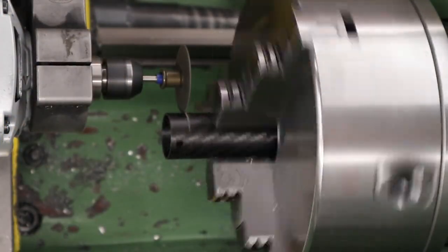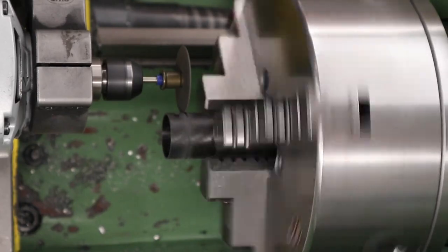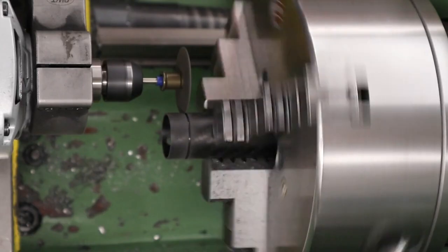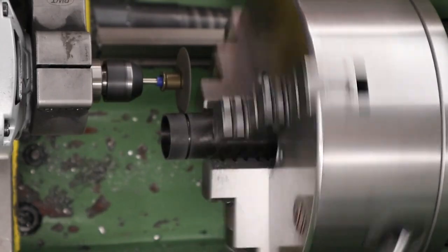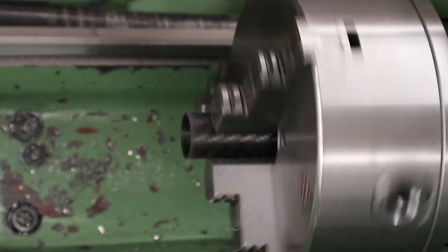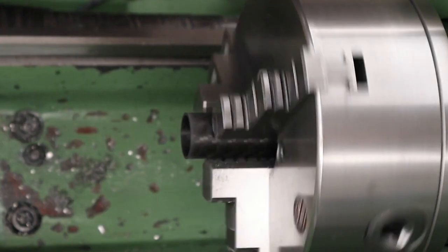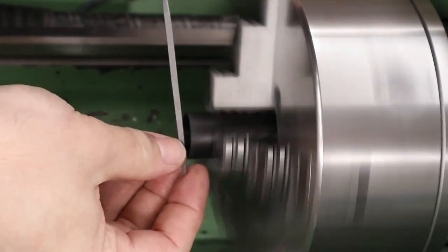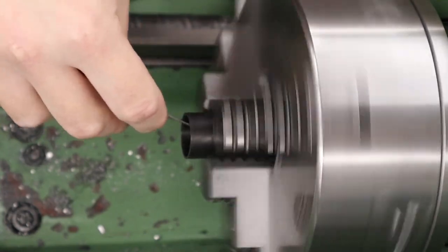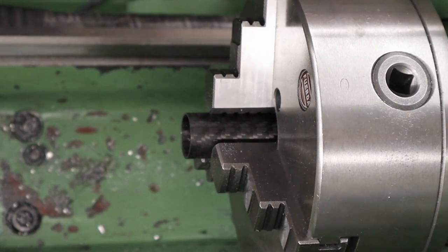The very last thing we've got to do is cut the carbon fibre to length, and we're just using a cut-off wheel to get it cut down. If you use lathe tools, what normally happens is the carbon fibre tube splinters on the inside. Using a cut-off wheel like this creates a nice clean cut and doesn't allow the carbon fibre to bust through on the inside. That's about done for the making of — I'll get all the parts anodised and then bring you over to the bench and we'll get the shroud fitted to the rifle.